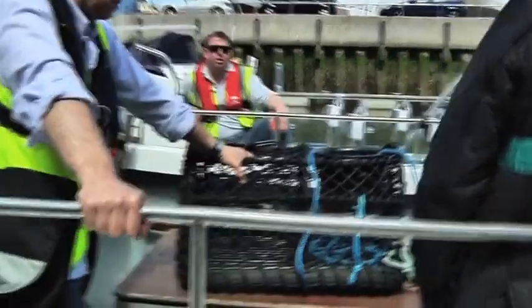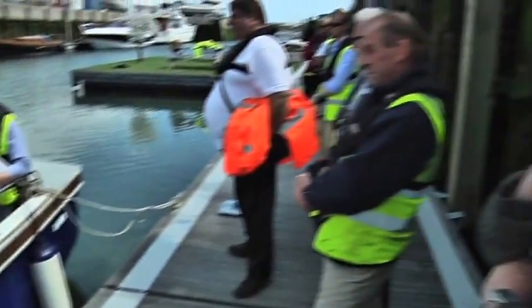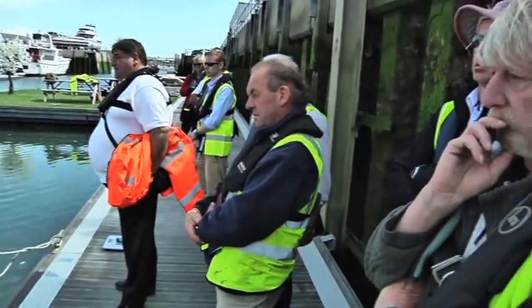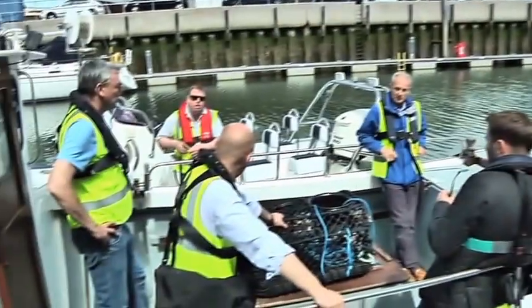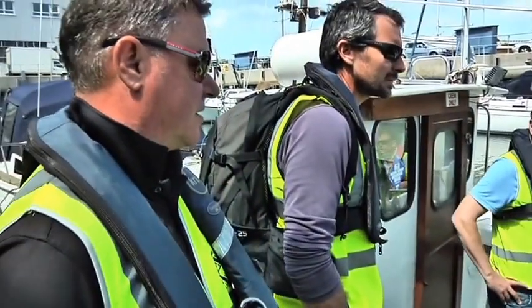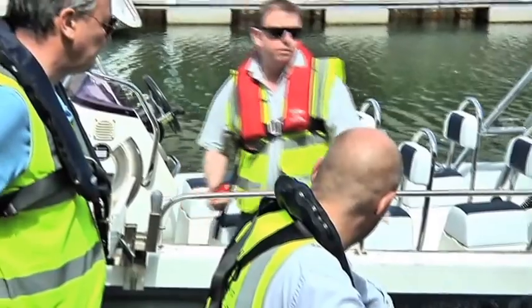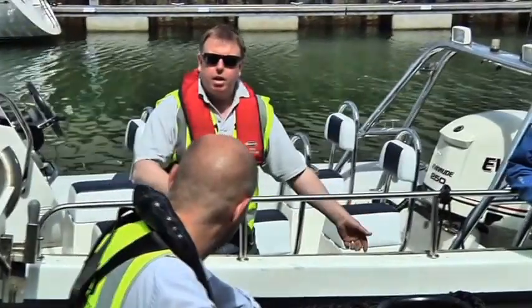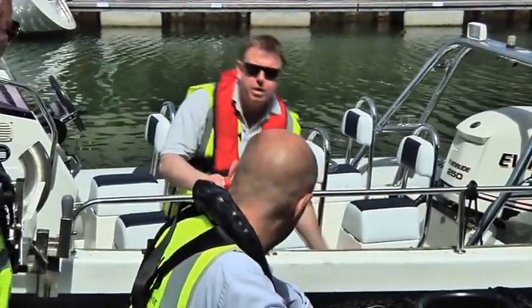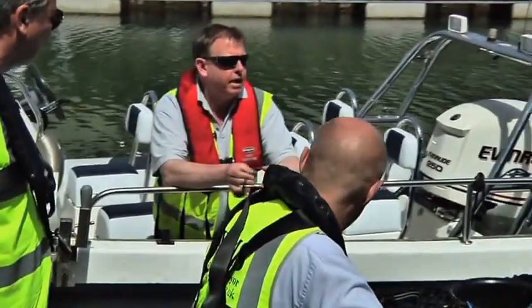That'd be an engine intake on some motor boats. It might be. There's a particular comment on that in MGN 280 about air intakes on hull sides. That's a separate bit on the form, isn't it? If you measure to the deck, and then it asks if there are any down flooding points lower than that. But where you get a vessel with a bulwark that's got scuppers in the side of it, you don't measure to the top of the bulwark, you measure to the scupper opening, because that's the point at which the water will enter the deck.